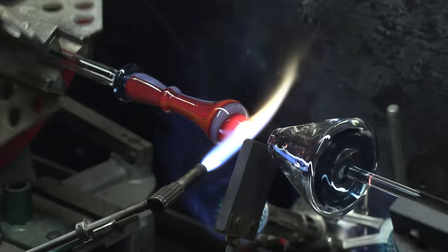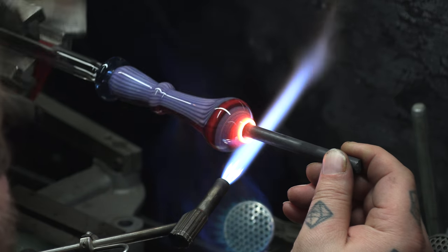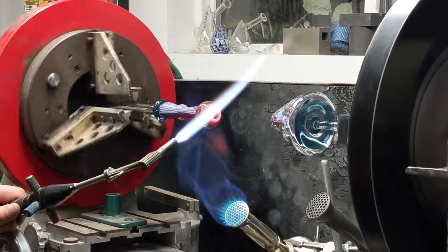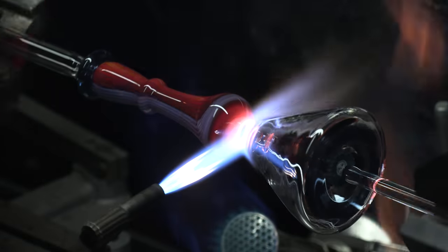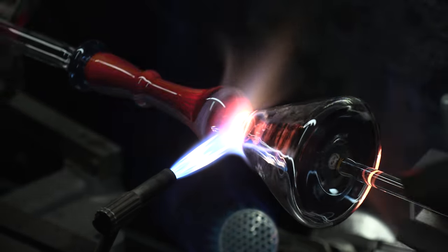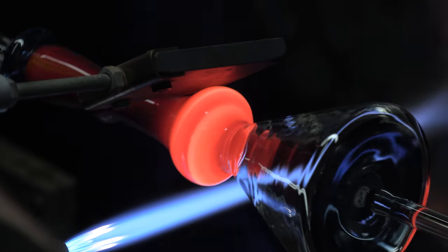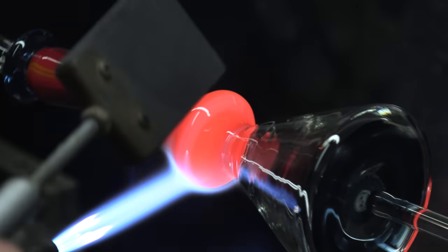I can see everything lined up here — I'm going to flatten that out and make sure it's really ready to seal. Opening it up with my graphite a little bit. Connecting the two, heating them up. The Bunsens are going and the lathe is spinning. You can see how that tail stock just slides right in — on a glass lathe the head stock and the tail stock rotate together. This can be easily accomplished without a lathe, but use the tools you have available. We decided to use the lathe since it's right behind us — little change of pace.